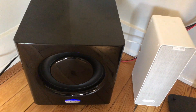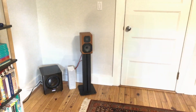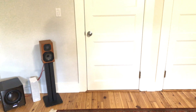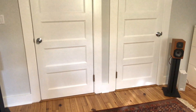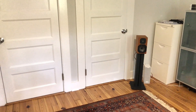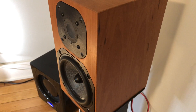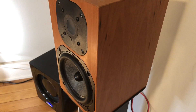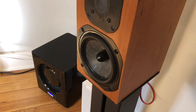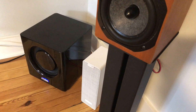So basically we're making a really high-fidelity 2.1 system powered by these inexpensive $200 pair of Symphonic speakers. Why go through all this trouble? You're actually getting a pretty amazing bargain — four separate power amplifiers, two for the tweeter and two for the woofers, plus a digital electronic crossover, which is a very expensive piece of equipment that takes the full-range signal and divides it between the amplifiers. You also get TruePlay, which is an incredible feature. To do this in the hi-fi world you'd need something like MiniDSP and spend a lot of time programming it, so you're getting all of that for free, which is pretty amazing.